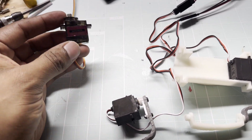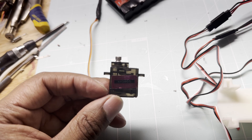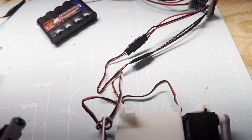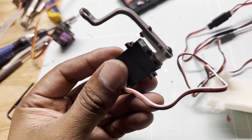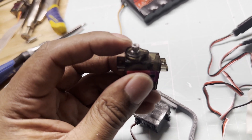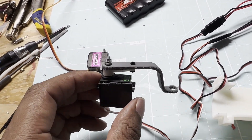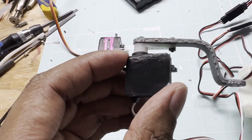Quick update: I had to get some stronger servo motors — these are the MG90Ss. They work, but they weren't strong enough to get the faceplate up. I went and bought some stronger, higher-RPM servos — I'll leave the link in the description so y'all can see what kind of servos these are. I also made some upgrades because of the sprocket on top. The sprocket on top is smaller than these ones, so the helper arm that I printed out doesn't fit. So I made a modification to the helper arm too.